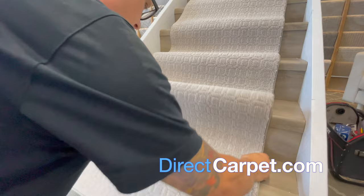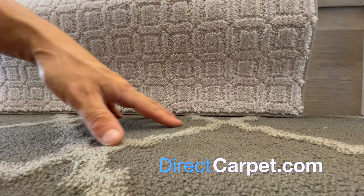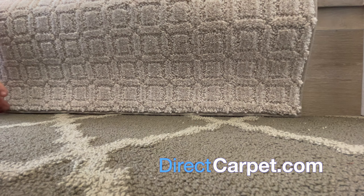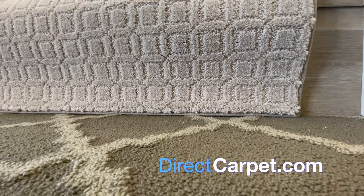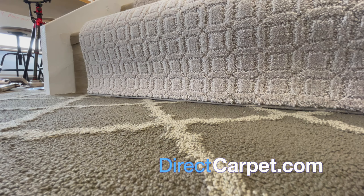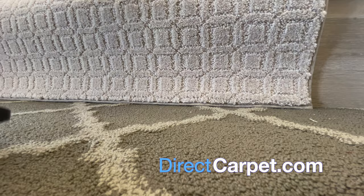So now let's get this bottom one started. Okay, let's try to give you a really good view. Now we've already lined it up. Now you can see, yeah, there's carpet here, but usually you would have hardwood. So you can see that our finished edge is there. And what we wanna do is get that in line, make sure that, there we are, should be about 4 1/8, I had figured. So we're 4 1/8. We'll double check the other side just to make sure. Yeah, 4 1/8. So now that we're in good standing and that we have the piece of smooth edge behind here, remember, we have that piece of smooth edge behind. That's what we're gonna staple into, because if this was ceramic, you would have to do the same thing as well. So we're centered,